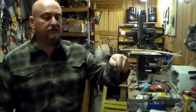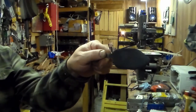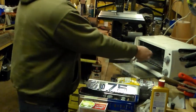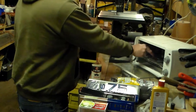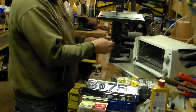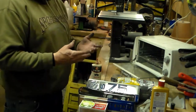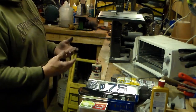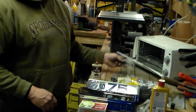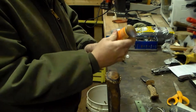You can get them pretty much midnight black if you want. Dip it in the water after you've let it set for however long and that stops the process. Dry it off, polish it up with a little cloth — that's the color you get, a nice dark blue tint. I put them in at 350 degrees in a toaster oven — I've been using that toaster oven for about two years, it does great. I do it twice: 350 degrees for two hours the first time, then about an hour the next time. I go ahead and leave the blue on it and then re-blue it once more for a second coat.